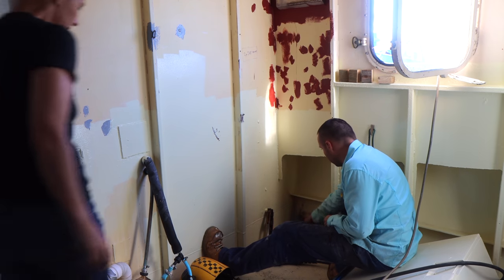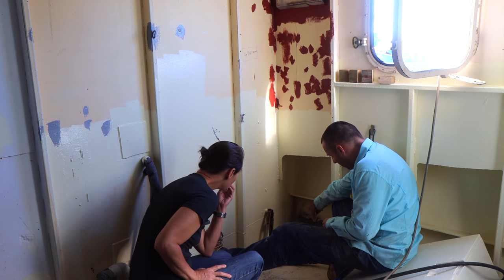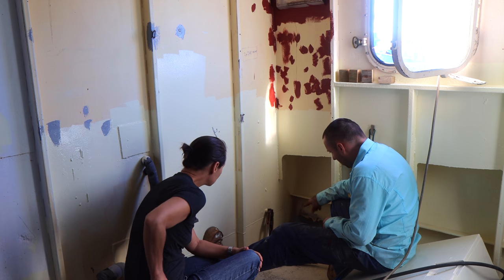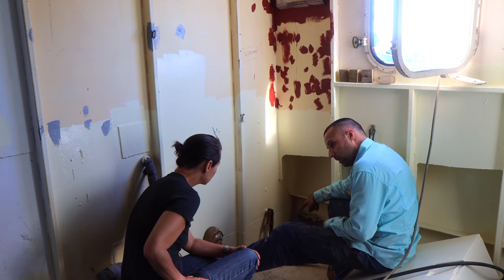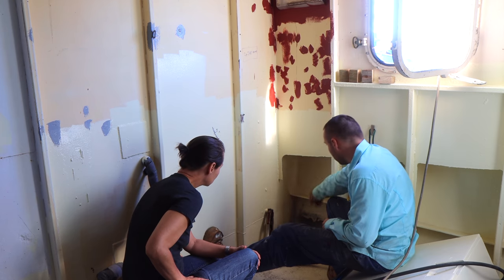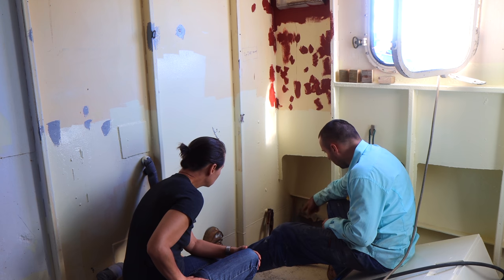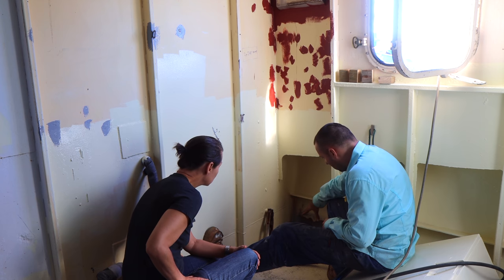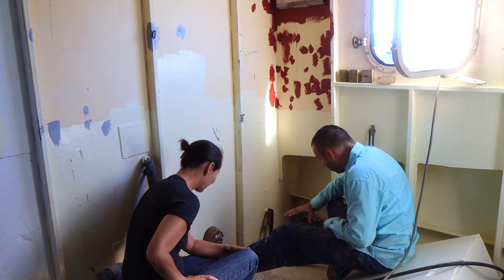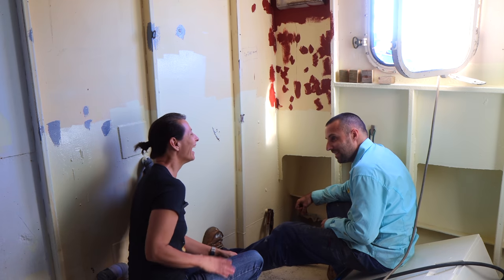So I've welded in the new steel in that panel there, but I haven't done the pinholes over that side. And thinking about it here, it's not a strength issue, right? Because they're only very small and localised on that bottom. We've still got this whole panel here that does all the strength with the welding. What I was thinking, blast this area out, get it back to bare steel, throw some epoxy over the whole thing, and then put some epoxy fairing compound.